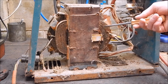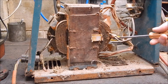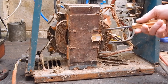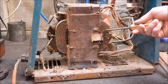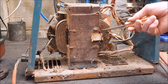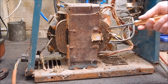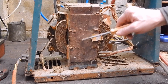But of course, it still comes down to the insulation qualities. The insulation will probably pack up before the copper gets that hot anyway. So copper's got better conductivity, but aluminium has still got very good conductivity. So they use aluminium on the later stuff because it's cheaper, it's lighter, and it does the job really. All your major high voltage transmission lines you see strung across the country are aluminium with a steel core. It would cost a fortune to do that in copper, so they just use aluminium and it does the job.